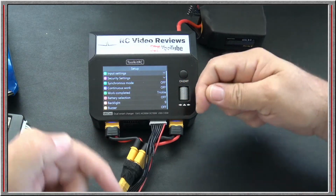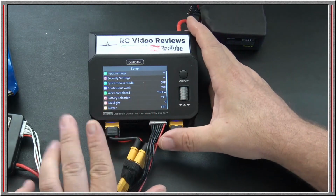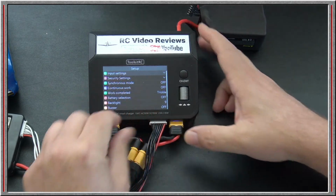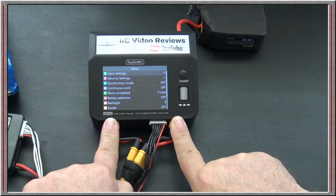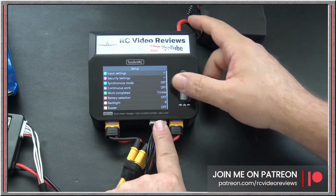We try and get way under the covers. When you're in synchronous mode, you only use one balance plug. It has 2 balance plugs, there's one here and one here, but we're in synchronous mode. So what we're doing is we're telling the battery logically inside that these two are one connection. So one connection, but one balance lead. That's all we need to do to balance.